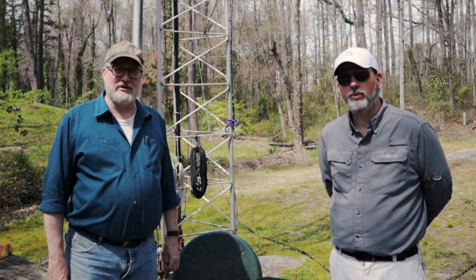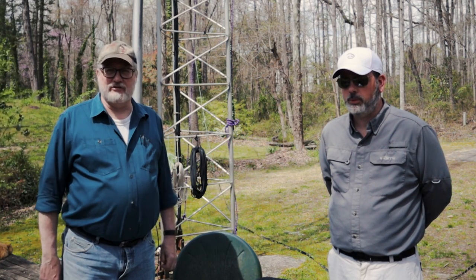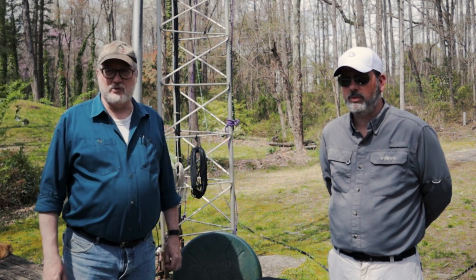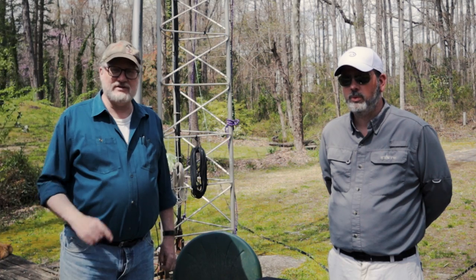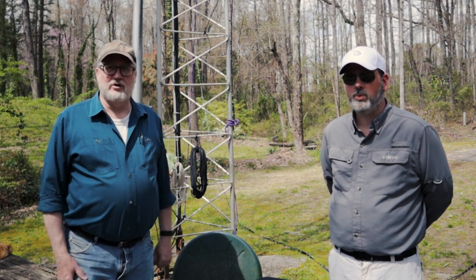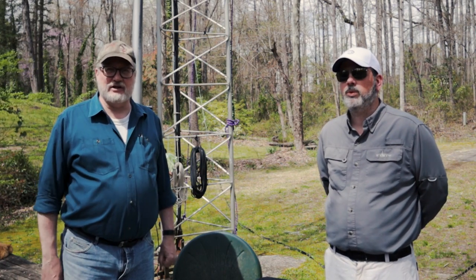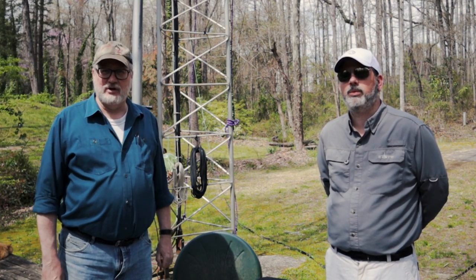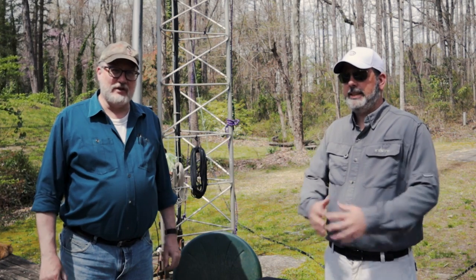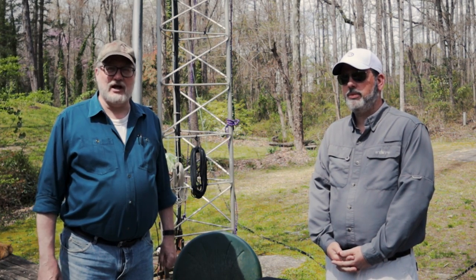No, absolutely not. And anybody who's bought one knows you're going to need some sort of matching device on almost every band you want to work with. With this antenna, you know you have 5 bands where you can transmit without having to worry about matching, and matching on the other bands is not really a problem. All right, so that's the introduction. In a minute, we'll look at the pieces and how we construct it.